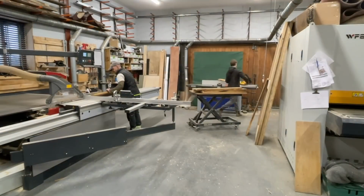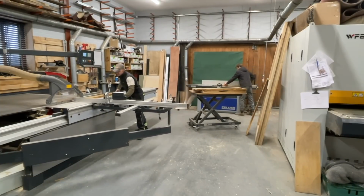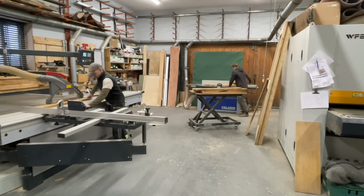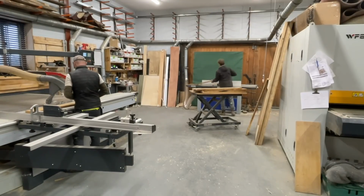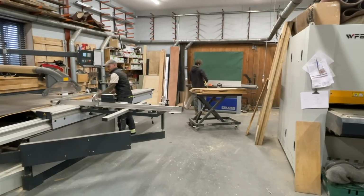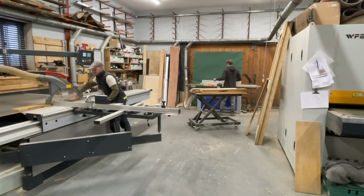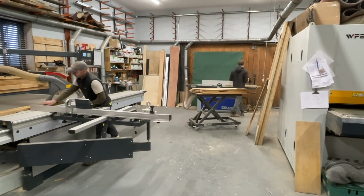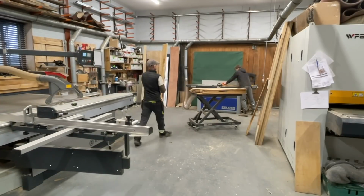Now we're moving on to the tongue and groove for the bottom section of the door. Now you're not going to have seen a set of doors made like this. The way I'm going to do this, I'm just going to float these tongue and grooves on the lower section until I pour resin on the back behind them. So a very non-traditional way of doing it, but I was trying to go for a very slick, simple, clean line outside, just the T&G and the oak, and on the inside is kind of a little splash of resin.